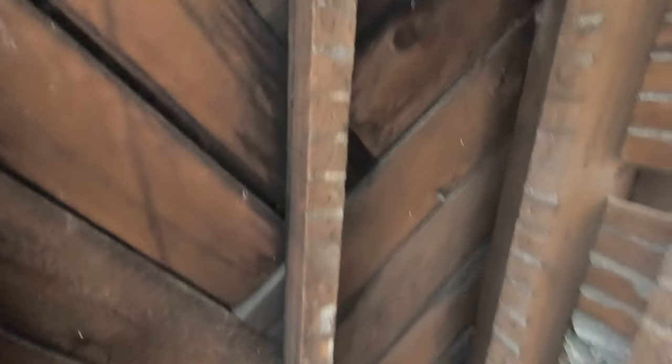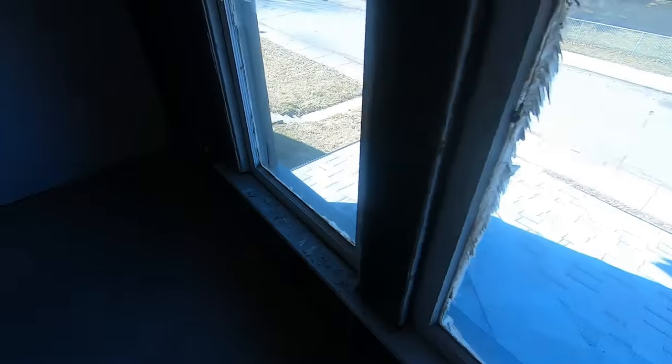That's part of the breathing that the house did. Back in those days, it wasn't that important that the house be airtight — they just relied on the heating of the house to breathe into these wall cavities and gradually dry them out. And that worked. So long as these wall cavities have been empty for 120 years, in spite of the staining, these boards are rock solid.